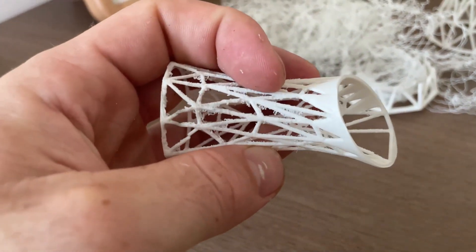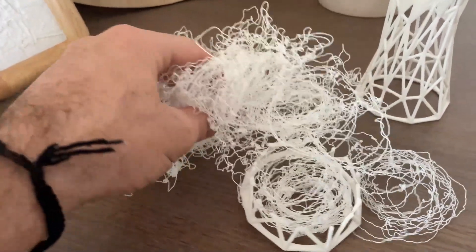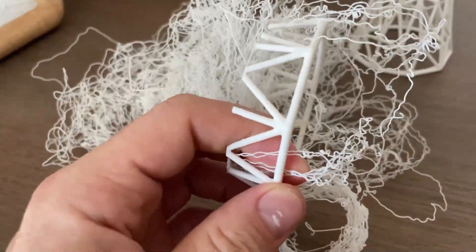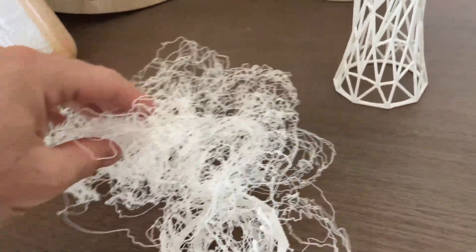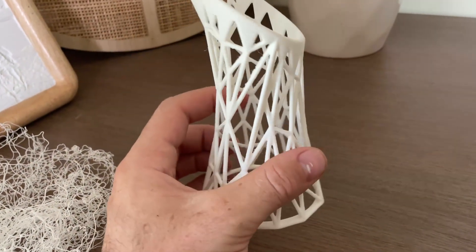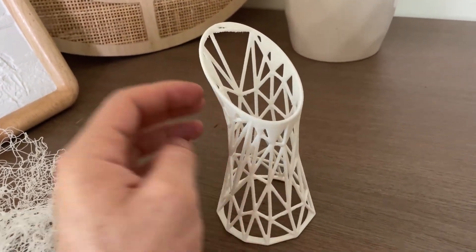This was a very important part of learning — temperature too high on these tiny little models is not a good thing. Low temperature is the key and you need a good brim. Here is the initial one with too high temperature, and here is a bigger one I attempted to create. That brim is really important — I tried to do it without one and it made an absolute mess, a waste of filament and time. However, I corrected this: I added a brim, reduced the temperature, and here is our final part — looking very good, clean, crisp, awesome. Good to go.